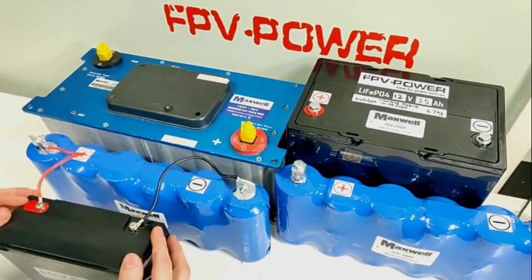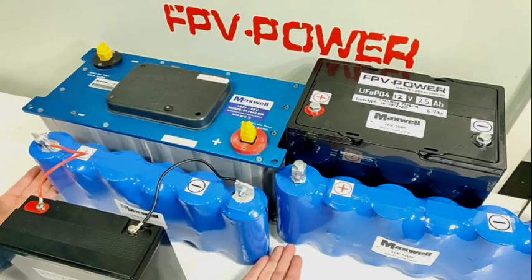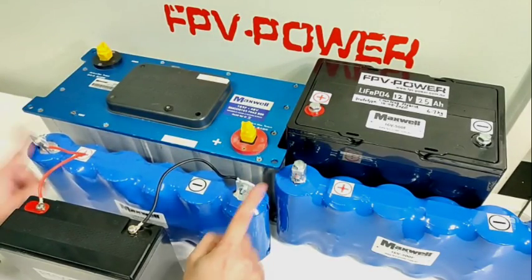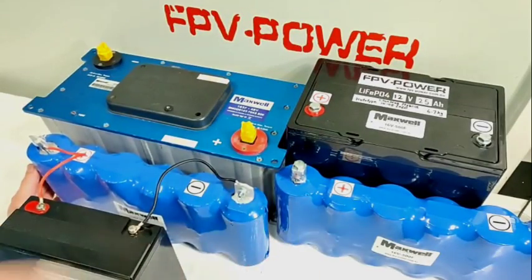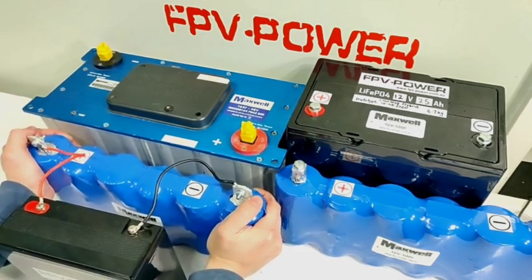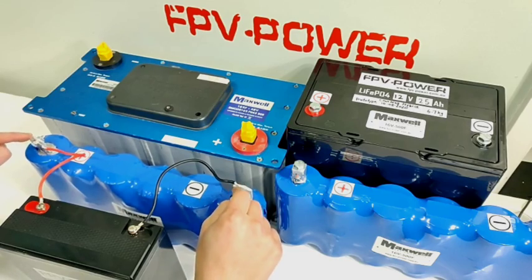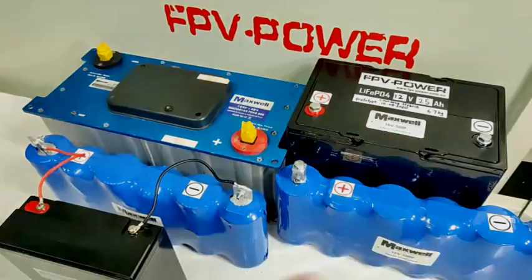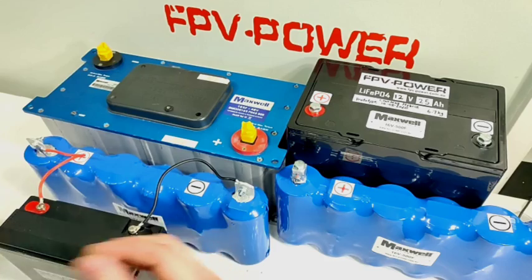And by the time that the alternator has started, within 3 or 4 seconds, this has already gone back up, because there's only 3 watt hours in this capacitor. Only 3 watt hours. So it only takes maybe 3 seconds, 4 seconds, to fully charge up again. If you were to get a multimeter and put it on here and check it, you'd see the voltage sag and straight away bounce back up right before your eyes, within 3 or 4 seconds, done. So that's why a supercapacitor is great for engine starting applications.